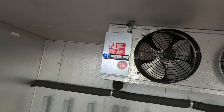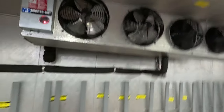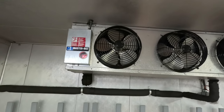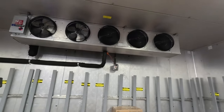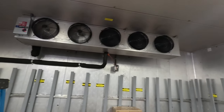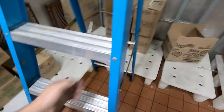Now you're seeing 'DN' — drain, coil drain mode — so we're giving it four minutes to drain, which is fine. There's also a fan delay — the traditional one you'd be used to. It should kick on here. This is what it was doing before — making noises and the crazy noise. Luckily no noise this time. Good — all fans are running. I'm out of here, guys.